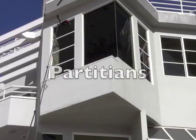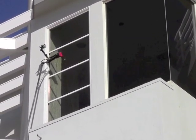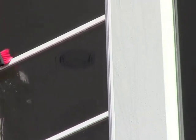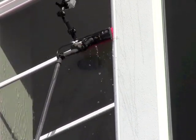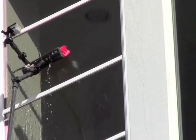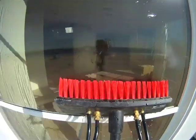Here we're working on some glass partitions where we have a sub-frame — about the same height as a window but there are four separate parts to it. When you're doing partitions you tend to get a little bit of a drainage issue coming from one pane down to the next, so you have to let the top pane completely drain before rinsing below that frame — just like working the top edges, it's the same concept. After you've cleaned a job a couple of times and it's well trained into the waterfed pole, you don't even have to worry about that issue.